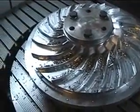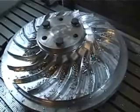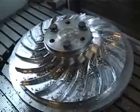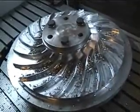We will clean the part and then inspect it with a manual micrometer to see the thickness of the blades and the bottom of it, and the height of the turbine to see if the planes are well. But we want to rerun the same program first in order to increase the speed and improve the surface finish.